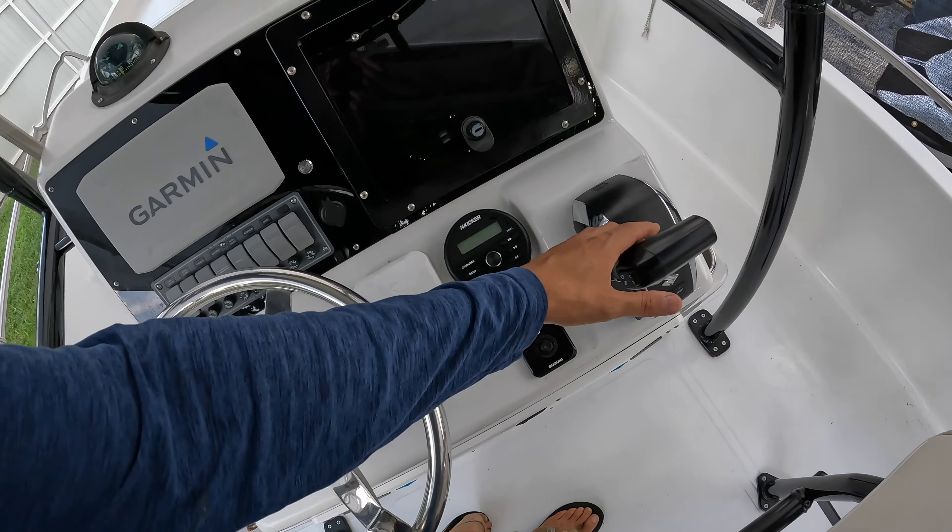You can see just how tidy everything is at the helm compared to before. We installed this acrylic backboard which makes everything look clean and nice. We got rid of all the old gauges and now we only have a Garmin — I believe it's the 73 SV model, a seven-inch unit. One regret is I should have done a nine-inch because we definitely could have fit it. We connected the NMEA connection so everything visible on the Suzuki digital gauge — RPMs, speed, temperature, fuel consumption — is also viewable on the Garmin GPS and depth finder.